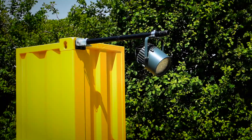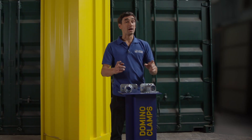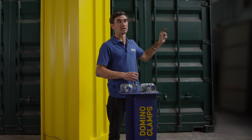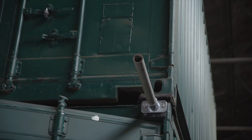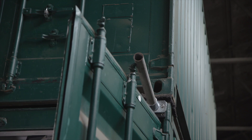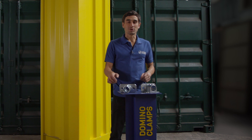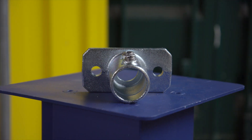The horizontal tube can be used to attach or hang other things off your container, like signage, lighting, drapes, banners — whatever you need. Please send us pics of what you use them for; we love to see them. Just be aware that when attaching these to the door end of the shipping container, the tube coming out of the tube clamp will obstruct the locking pins on the door and prevent your door from opening fully.